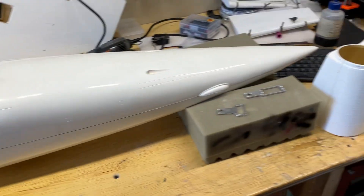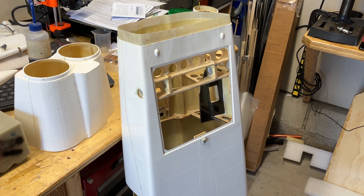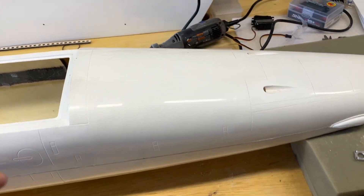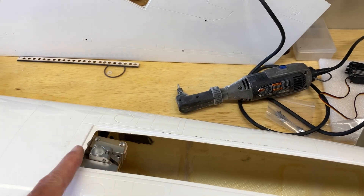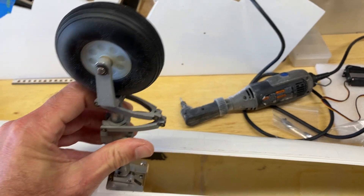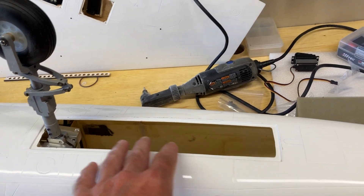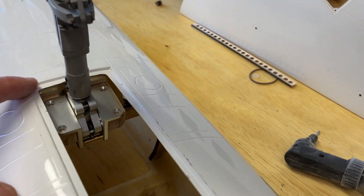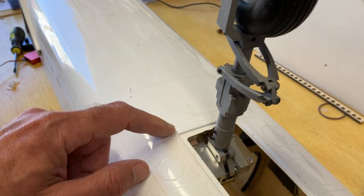I'm moving slowly but surely. I've been kind of random with this thing — I just look for some problem I want to get solved and jump on that one. I've still got plenty to do: all these will be gear doors, and it has a split gear door setup. There's a rear gear door that I'll drive with a spring off the nose gear strut, and then a main side-opening hatch that closes when the gear is up. The rear door shouldn't be too bad, though there's not a lot of room for hinging so I may have to make some semi-custom hinges.